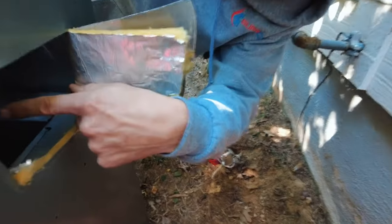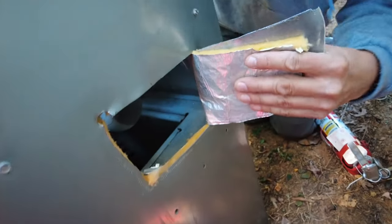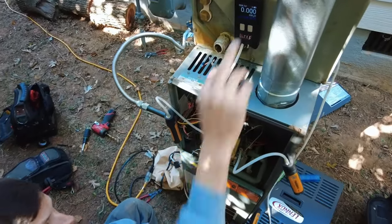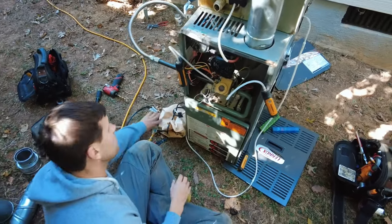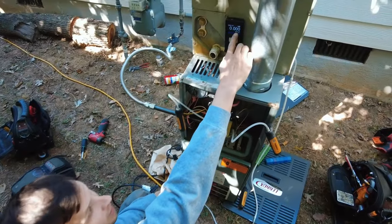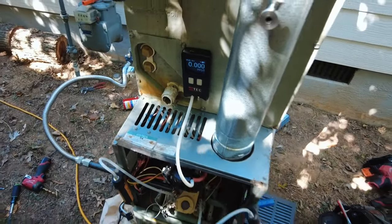This is probably one of the most common spots to see a heat exchanger blow out from the flame — at least in package units. We started with a quarter-inch self-tapper hole in the back of the heat exchanger. Running on the highest speed tap with a little hole in there, we have not seen any increase in water column across the pressure switch. It's less than a hundredth of an inch — nothing that would even show up on a normal manometer reading to hundredths of an inch of water column.